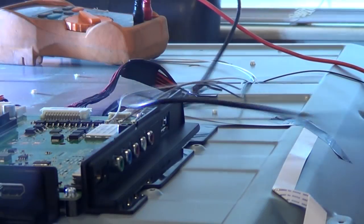Basically how this TV is set up, there are actually 6 rows of strips with 18 LEDs on each strip. The strips do come apart, so there's actually 12 strips - they come in half. What happens is if one of the LEDs opens up, the other strips will light up except for that one strip.